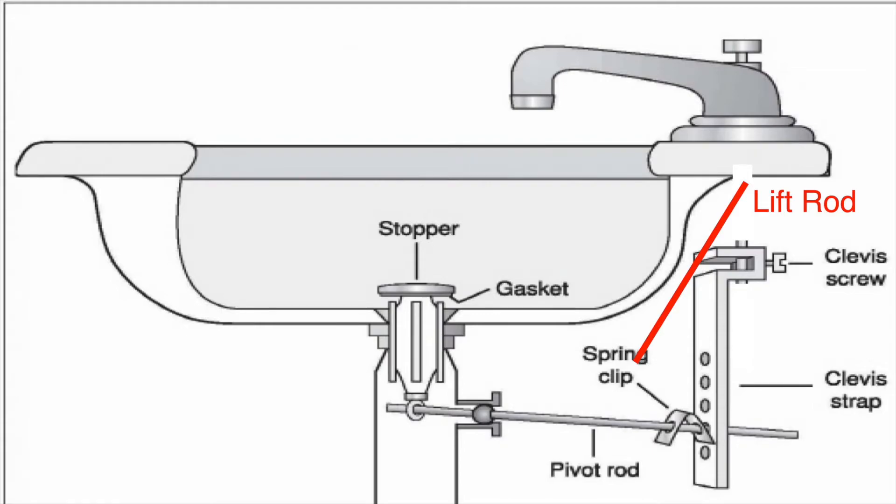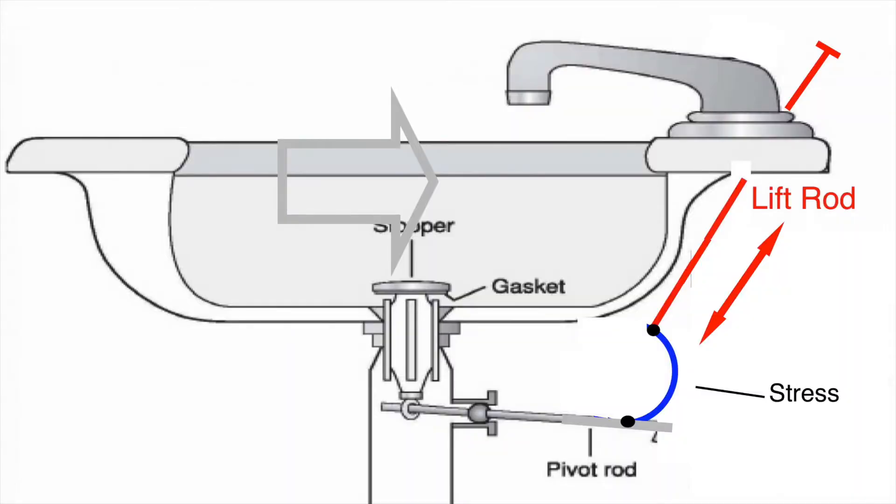About three months ago I thought I was done recording the bathroom sink installation. But what I discovered was that because of the design of the rod that pulls the stopper up and down, it didn't work in this sink — the faucet has a rod that is angled instead of going straight up and down. Between that and the curvature of the sink, there's a little metal strap that connects to pull the stopper up and down, and eventually the strap broke. So I've ordered a different stopper — much simpler, the top just pops right out. Today I'm going to try to put that in and finally finish this job and get the video up on YouTube.